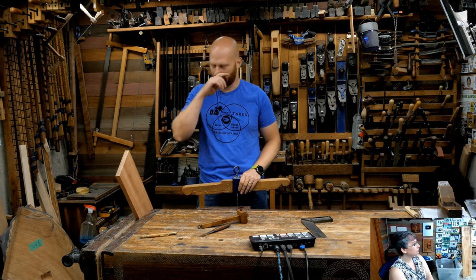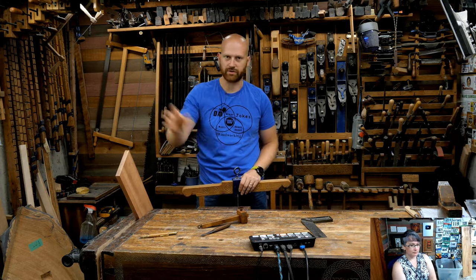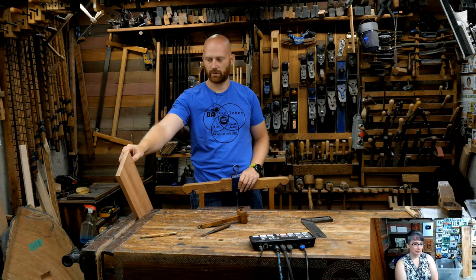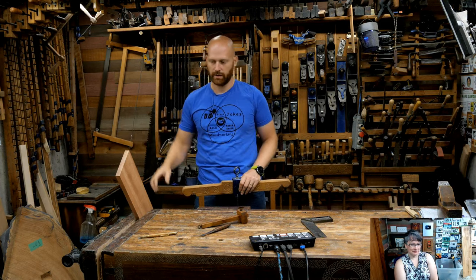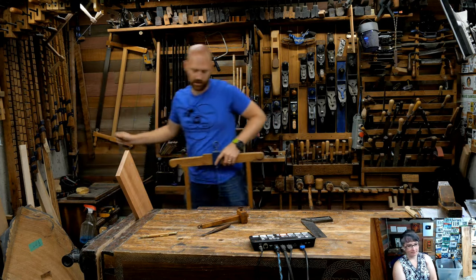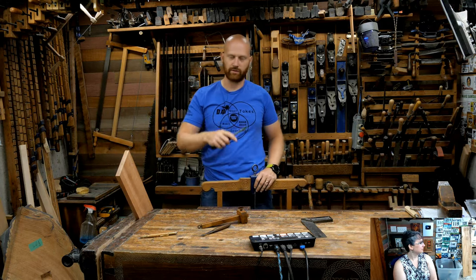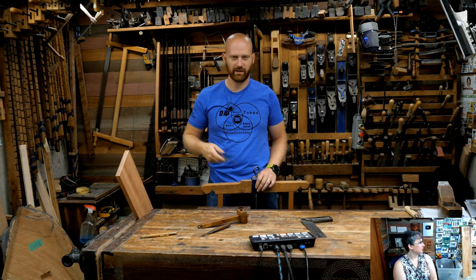No. If I wanted to have continuous grain going around all the sides, then I would have to make them sequentially out of the board, so I'd have to make it longer. And so if I want them to be thinner, like the resaw at work, I would have to make it 4 sections long and then make sure that those are all sequential. For grain like this, especially if we're planning on doing dovetails, sequential grain really doesn't matter because you won't see it as it wraps around dovetails. Now, if you're doing mitered, then you could do that, but that would be a lot more work.